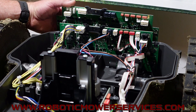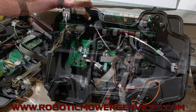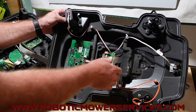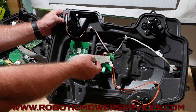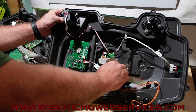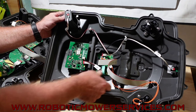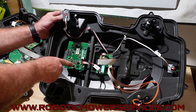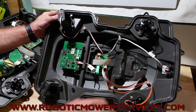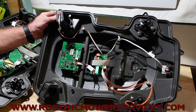Now I'll pull up the upper chassis and show you, because that's where there are some big differences. First, this is the upper chassis off of a 450xh — we have this one apart because the ribbon cable was kinked, so warranty department, there's your evidence. You can see we have our lift sensors, the standard stuff. We've got our HMI board here, our comm board back here which works with the Automower Connect and GPS, and a sensor board up there for collisions, lift, and rear collision. Pretty simple, not a whole lot going on under there.